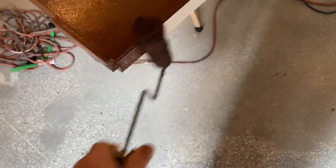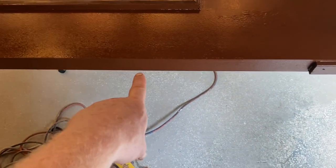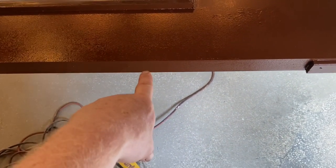You know, when you open and close your wooden door and it doesn't shut when it's humid out? Well, one of the ways through which humidity and water enter your doorway is right here. This part and its sister part at the bottom. You want to seal these areas with paint and a clear sealer as well.